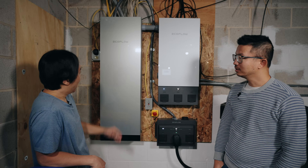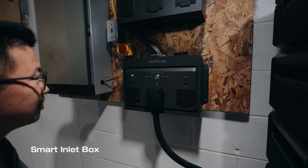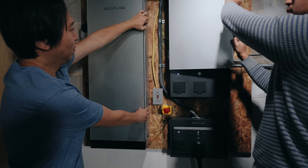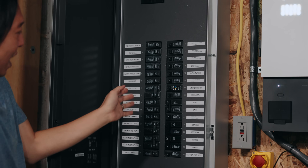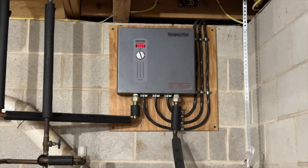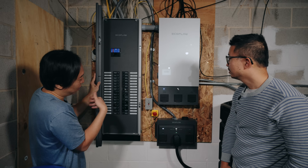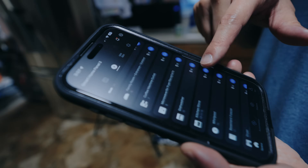Are you using this as a main panel right now? Absolutely. This used to be an old dumb panel, but now the Smart Home Panel 3 is the main panel. I love how the two parts are separate — if you don't want the smart bits, you can just have it as a panel by itself. You don't even need the inlet; you can remove it. I still have the Smart Home Panel 2 as well. I have a very high-power appliance — the tankless water heater — that has to be on its own circuit in the old subpanel. Why not move Smart Home Panel 2 in as a subpanel connected to Smart Home Panel 3, so everything will be smart and I can monitor everything on the app — usage, on and off? Everything works.